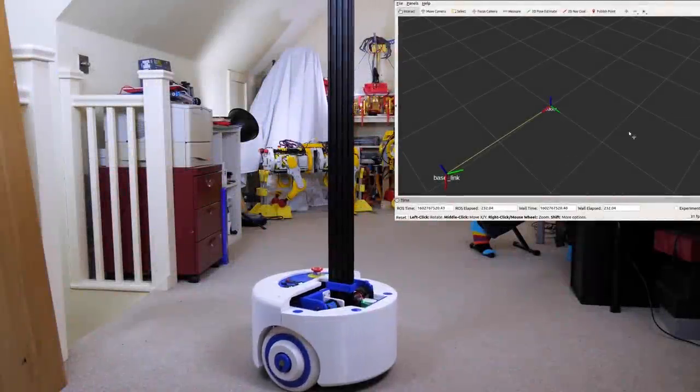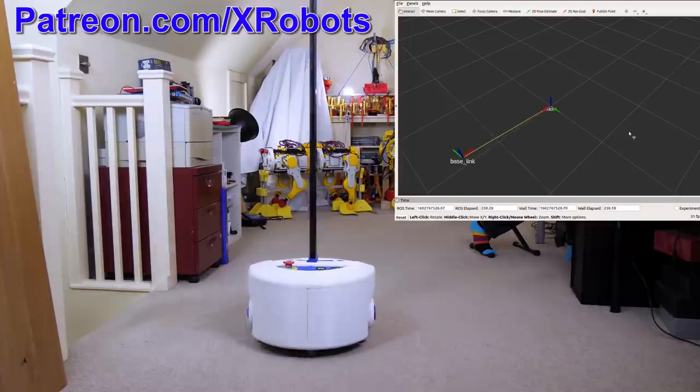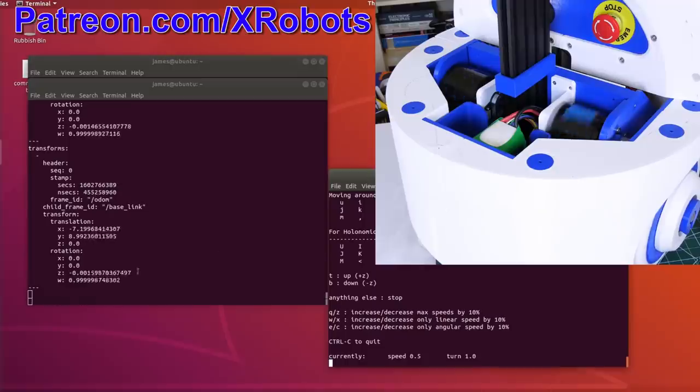Most robots which map and navigate their environment autonomously use wheel odometry to work out what their position is, as well as other sensors. This means measuring how far each wheel has rotated, knowing the circumference of the wheel, working that back to how far the motor has run through gearboxes, and measuring encoder counts on each motor to work out with trigonometry the robot's position and its rotation in space.